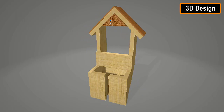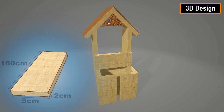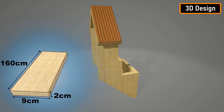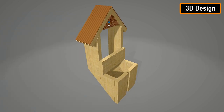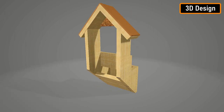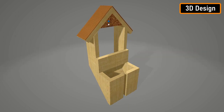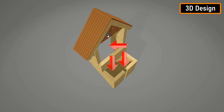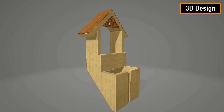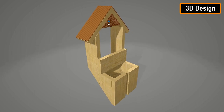Now let's look at the design of the peg box. Using freely available pallet planks, I designed the body of the box. The pallet planks I am using are 160 by 9 by 2 cm in length, width, and thickness. The top bit of the peg box will house the microcontroller and the sensors, which prevents the electronics from adverse climatic conditions. The back bit will stick to the wall, so we do not need to cover it. You can put the pegs straight in the front bin or throw them to the top bit from where they will slide down. The sliding design with an opening in the front will prevent rainwater from accumulating inside the bin, keeping it dry throughout the year.